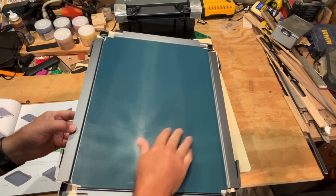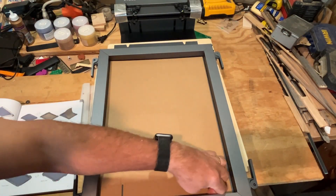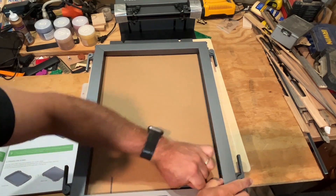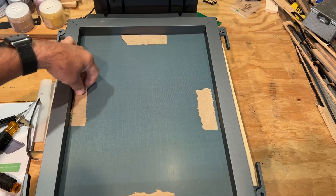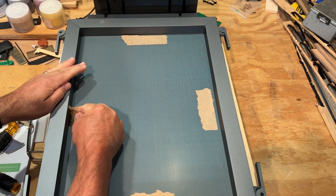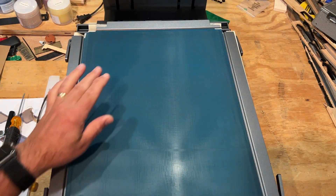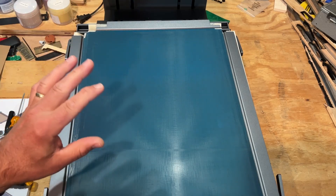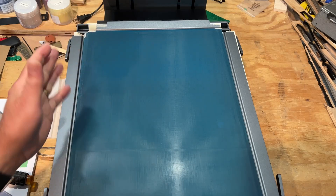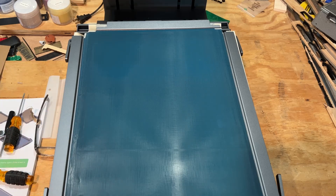Check it out — you can test that it's taut and everything's straight, and we're ready for laser cutting. Now that we've got that tightened, we can reach back here and find these little pieces to pull the cardboard out. If this sticks, you can get your fingernail under it and just peel that back so that it removes the way it's supposed to. If you're having struggles with that, you can also get it damp as you peel it off. So with that removed, this is tight like it's supposed to be, and now we're ready to do the magic part of making our design.